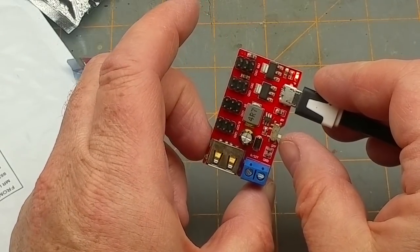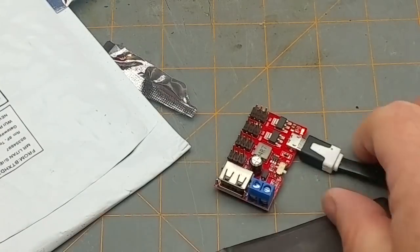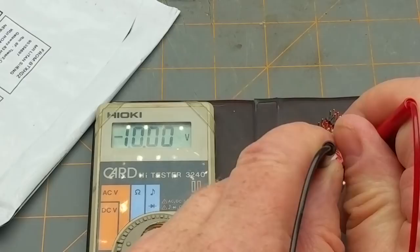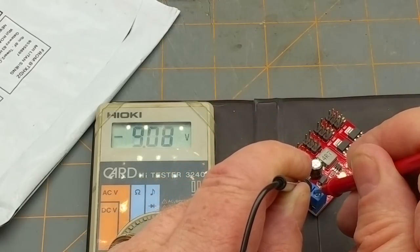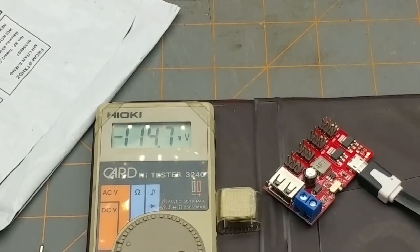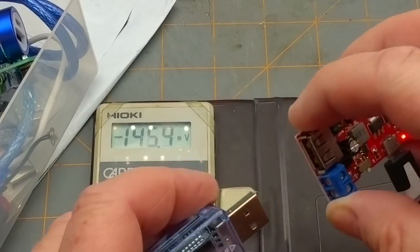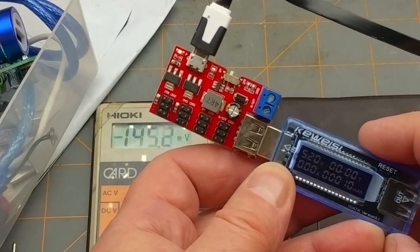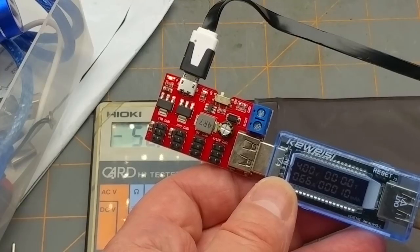This little switch here says 9 volts in that position and 12 volts in that position. Let's get this into DC voltage — is that an output? It is — it is 11.88 volts. I'm going to guess it's 9 volts when I do that. Yep. Alright, hang on, let's get a USB volt meter and plug that into the obvious place. Oh, that's tight — there we go. Flip around — 5.2 volts, that'll do nicely. See what happens when we put a load on it — sinks down to four even, 0.66 amps.